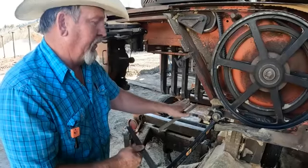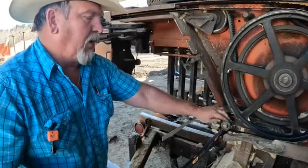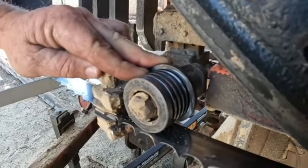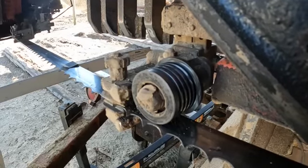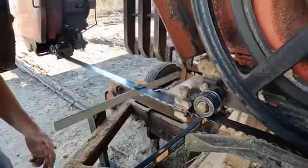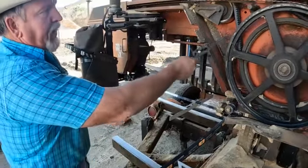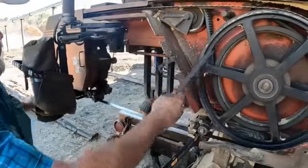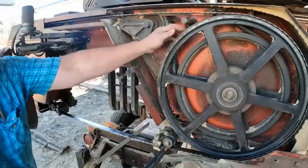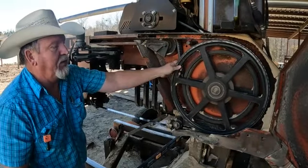Your adjustment bolts in the back — you've got them on the top and on the bottom. I'm going to show you on the outside blade guide roller because it'll be a little easier to see. You've got bolts on the top and the bottom of that little receiver, and then bolts on the left and the right. Those top and bottom bolts are how you adjust the tilt on your blade guide rollers. The left and right ones will adjust the alignment of the flange to the back of the blade.